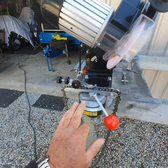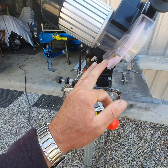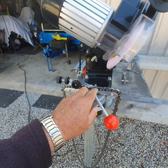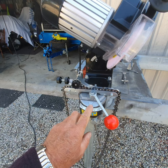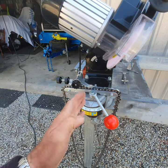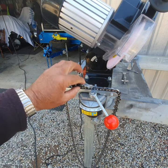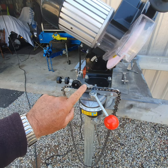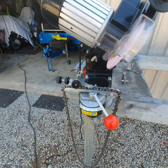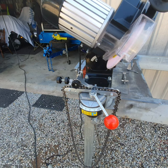At zero degrees you can change the wheel to one without a radius — a flat angle — and set up to do your rakers with a different wheel. There's also an adjustment that controls how far the tooth comes in contact with the wheel. Then there's a side adjustment: when grinding on one side, you adjust this unit to push this metal tang over to the other side so you don't grind it off. If it gets too short, you'll end up grinding into the metal stop. So we'll set that up.